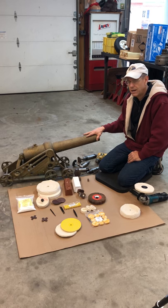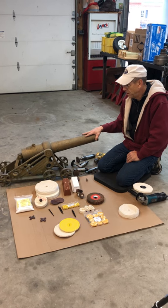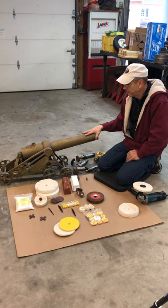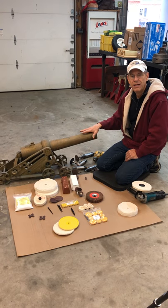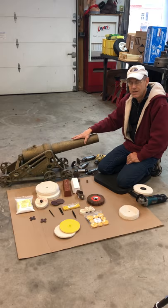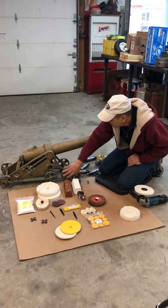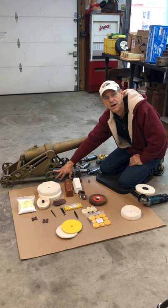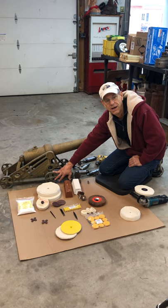This one's a little bit rough — it was a sand cast cannon, so it has some of the rough pebble grain finish left on it and we're gonna have to sand that down. In places already sanded and polished, we'll sand with 180 grit then 320 grit and then buff. In areas that are rough cast, like the wheels and various things, we'll sand with 80 grit, then 180, then 320, and then buff.